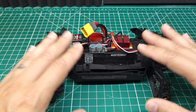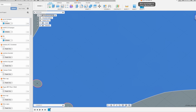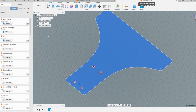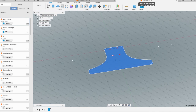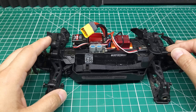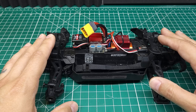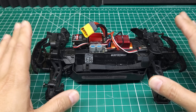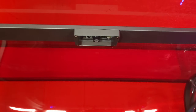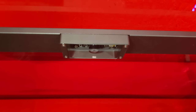Unlike 3D design, this is pretty straightforward because all you're doing is creating a single flat sketch. So I'm going to do a sketch in Fusion 360 — all we're going to do is create our holes and a basic outline in a design that looks good. Then we're going to export this out and import it into a program called Lightburn. Lightburn is the best software you can use for laser cutting. This Creality Falcon has a camera on it that's been calibrated so I can just take my material, plop it on the bed, drag my cut image over it, and then adjust a few cut settings.